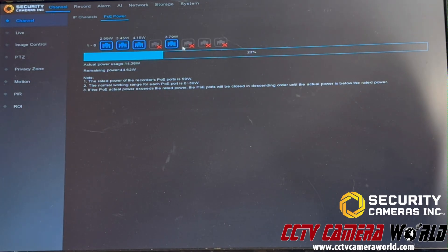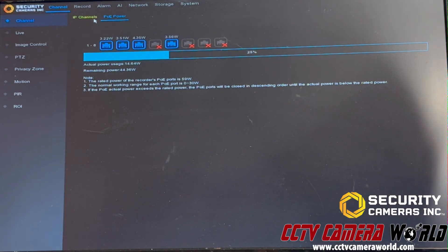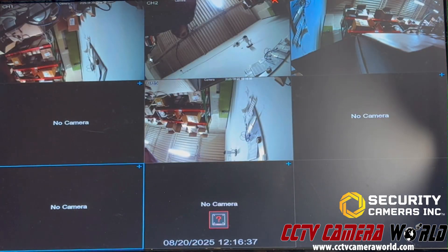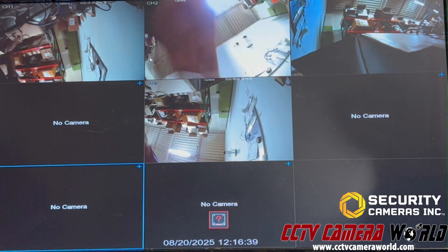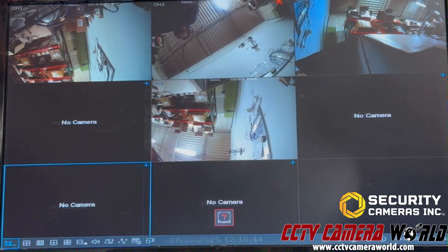You shouldn't use motorized zoom cameras — not too many of them — and PTZ cameras are not supported for extended POE runs either. You should stick with fixed lens cameras like the turret cameras I showed you, or motorized zoom cameras that don't have a high power input. Now in my channel list, it automatically populated. The camera list changed to 10.10.2.2. If I right-click out, I can see my camera and wave my hand in front of it. This is the camera that was missing before — it's a pretty easy plug-and-play process.